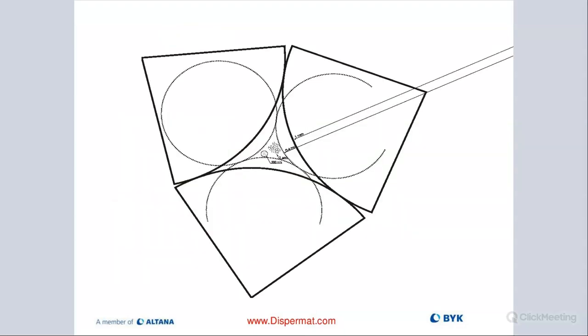Okay, so this slide shows you the same thing as the first bead slide, but here you see it more broken out. You see the larger balls here, these are the beads. And then we have the particle or the aggregates in that smaller circle in the middle. That's actually where the shearing takes place. By the collision of the beads, right in the corner where they meet is where the shear forces are being created. And that will actually push that particle away. And because of the shear, it will break up these binding forces and turn these aggregates into smaller particles.